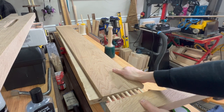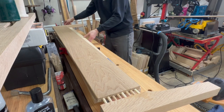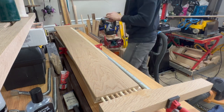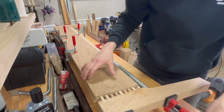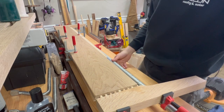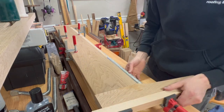You'll notice I have a thicker board underneath — that's because there's so much clamping pressure that if I just had that white oak board, it would buckle and bend and snap. So the thicker board underneath acts as a brace, and I clamp down the white oak board to it to make sure it doesn't buckle under the pressure. In this first glue-up my clamps weren't long enough, so I used two five-foot clamps attached together, slowly tightening each to bring my two legs tight to the centerpiece.